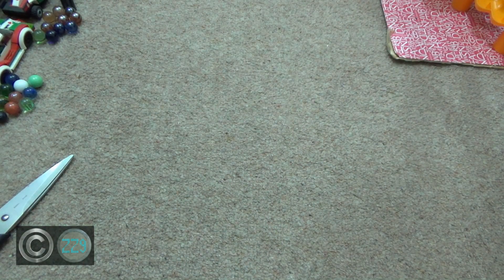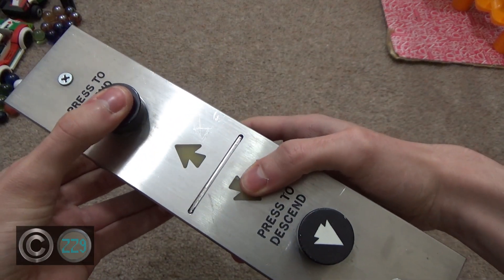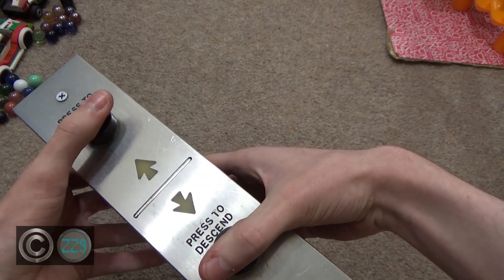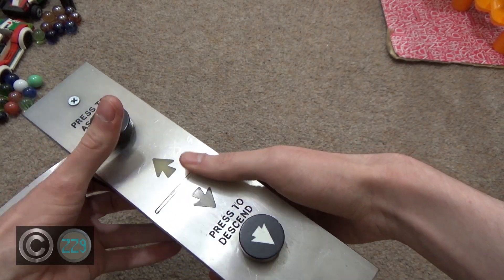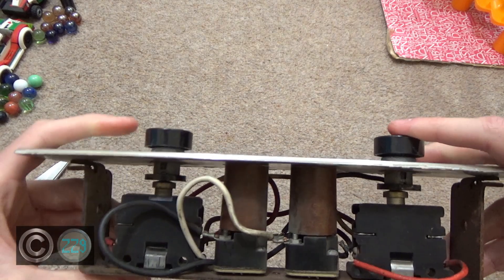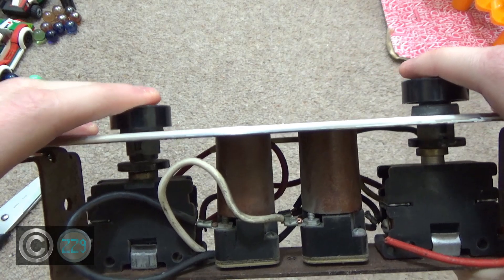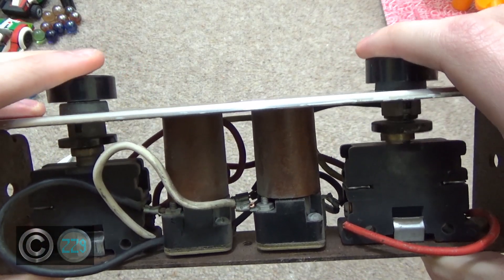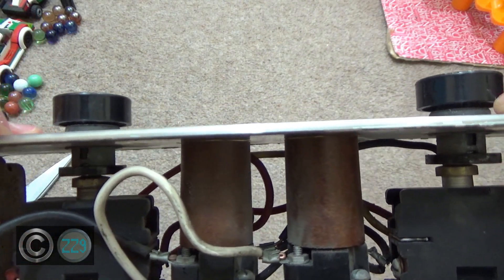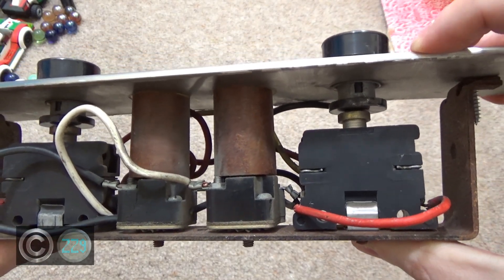So with that being said, here it is. Screw there, screw there. This button's a bit weird — that's what it looks like now that the screws are on. It's just a bit worn out. It's actually the up button that looks more worn out, but you can see the plate is in great condition. In the back here you can see how these buttons work in practice — the black button piece pushes down on the actual button piece in the guts, which closes the contact and completes the circuit. It's a really neat little button system. The two tubes in the middle are for your light, and those go right up against the panel so there's no dispersion of light anywhere else — you get maximum light on the arrow. I've hidden the wire ends just in there so that it's neat to display.